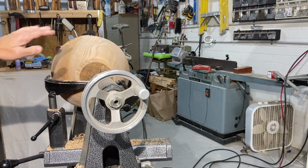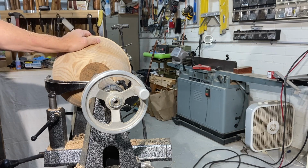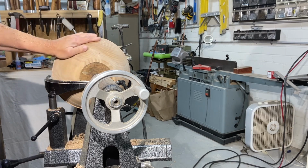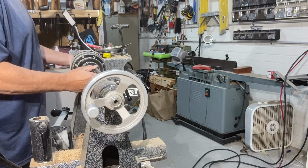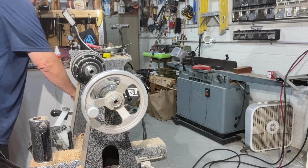What I'm hoping to do is actually put my bowl saver on this and get another bowl out of the inside of it. The total depth of this is 4 3/4, the other one's 5, so I should get a nice bowl out of the inside of this. I'm gonna clean this all up and sand it and then flip it around. Wow, that was in tight. That is the 2-prong drive chuck, drive center.